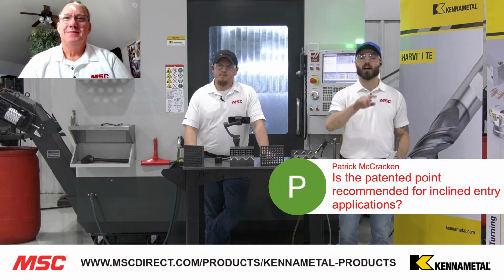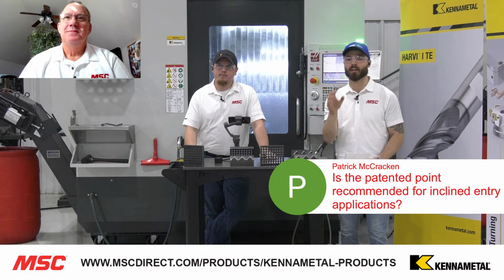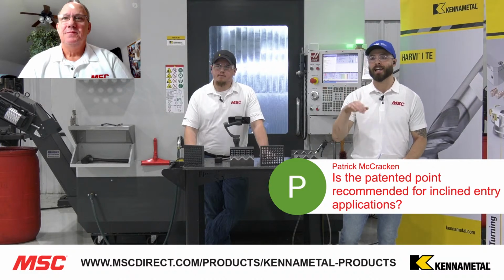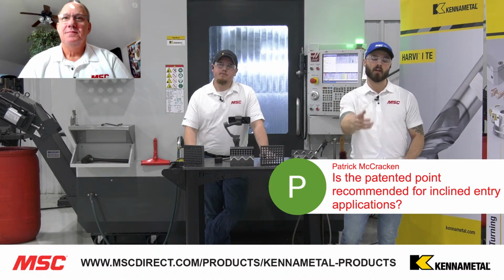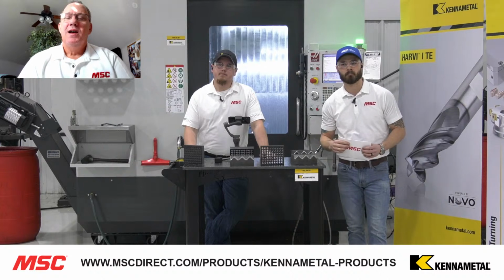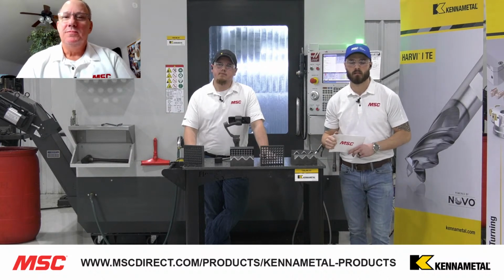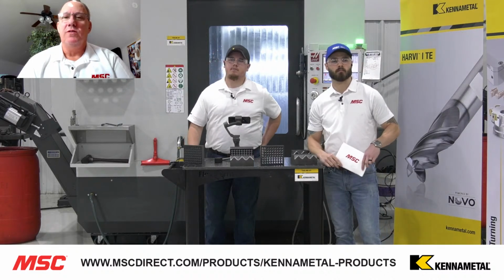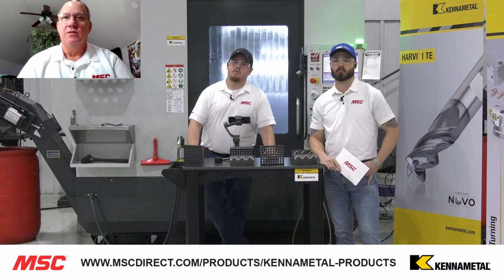So hey, aside from that, before we finalize our last demo here, we got our man Patrick. So is the patented point recommended for inclined entry applications? What do you have for us, Tony? If we were doing a short one, probably the 3xD, you could get by with it. But if it's going to go any longer, then I would definitely recommend a spot drill.